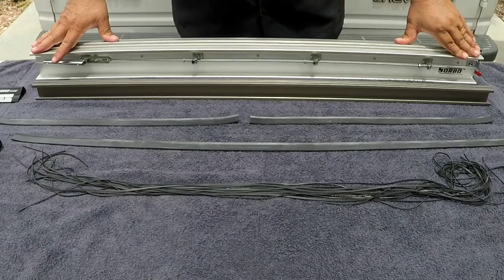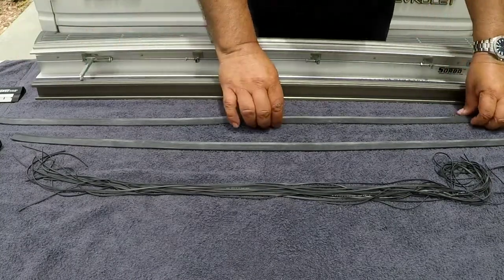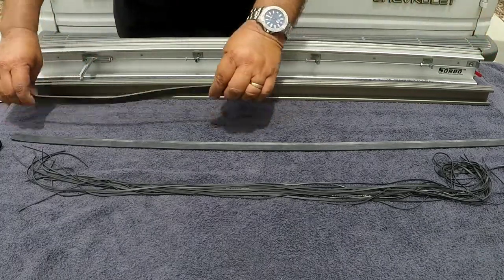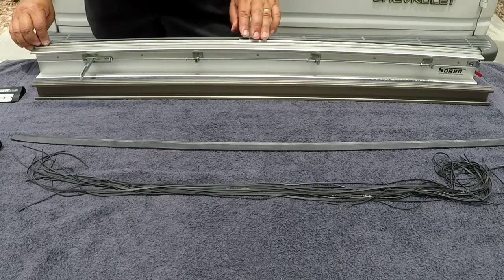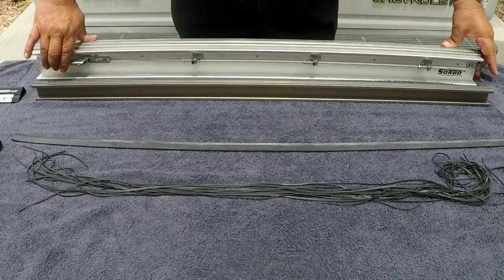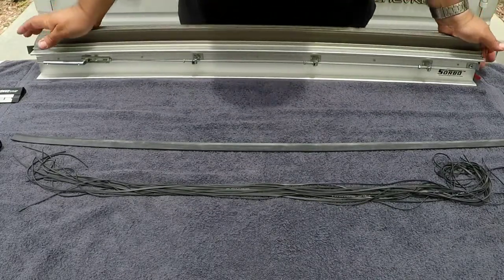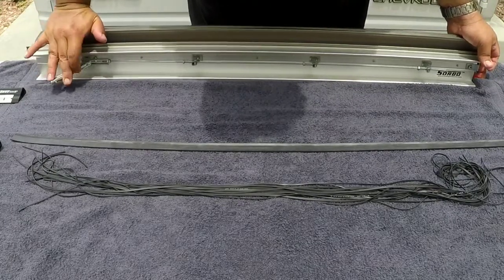Okay, now I'm going to demonstrate how to cut two 18 inch squeegee rubbers. Open it up. Grab one 18 inch squeegee rubber and put it here on this side. Slide it across so it hits flush against the stop. Grab another one and put it over here on this side. Now leave enough gap here so you can put your trimmer. Close it up. Grab your level stop, put it here on top. With the palms of your hands press firmly down. Put your finger on the red lever, pull up — same time open it up and close it.